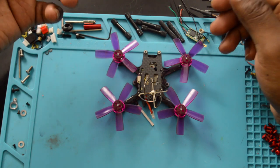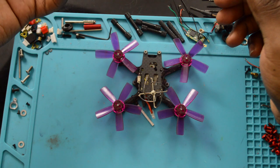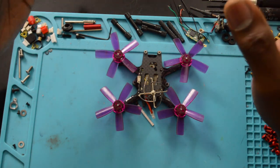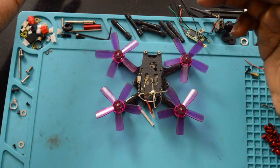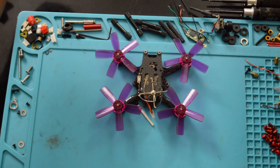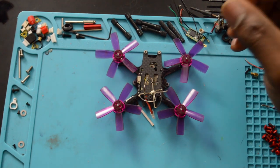Yeah, so in this guy, it's also my batteries that are causing that, but I've kind of balanced it out, in my opinion. It flies incredibly smooth, and from what I've seen, versus the stock PIDs and my PIDs, it flies a lot better. There's very little prop wash when you're just banking a corner, you cut your throttle a little bit, and then you blast it back up. There's no prop wash there.